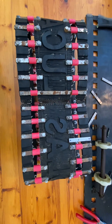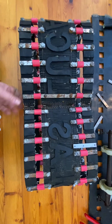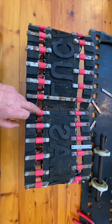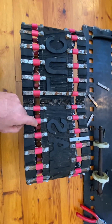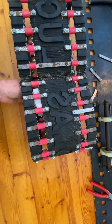This wasn't repaired by me originally — it was a guy I'd lent it to, and he put just regular flat stock on it. He didn't measure this one window right, but it made no difference at all. Instead of having a one-inch lug and a one-inch window, it now has a three-quarter inch drive lug and an inch and a quarter window. The sprocket fits inside there and it drives absolutely perfect.